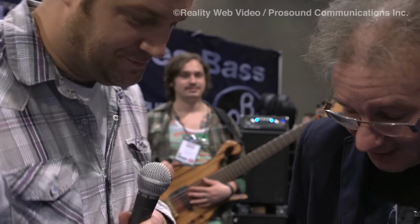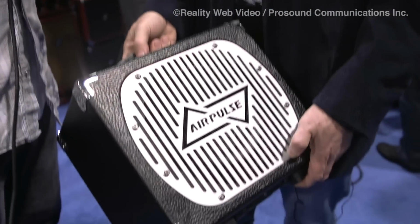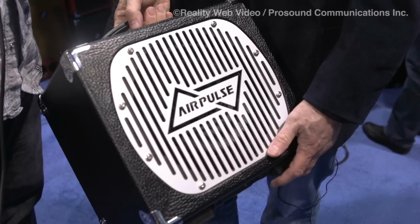The other thing is this amplifier is 125 dB output at 1 meter, acoustic dB. That is unheard of before. And the reason is we've got new technology in the speaker. The speaker is a liquid-cooled ferrite magnet 8-inch driver. I can't even talk about the voice coil, but it's all secret. We've got a whole bunch of things, but it's a 500-watt 8-inch loudspeaker. The amp can peak at 800 watts and it'll take it.